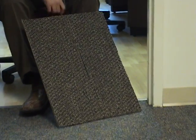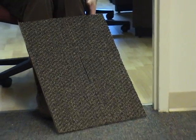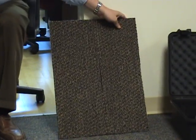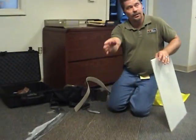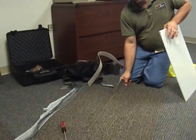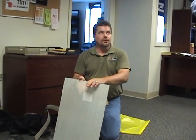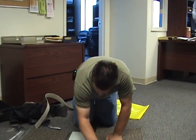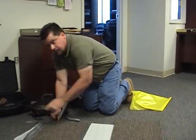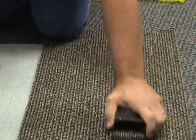Double cutting is like wallpaper. You put one piece on top of the other and overlap them, then cut through both pieces. Because of that, there's no way to keep it square. If it's skewed, you're going to cut through and get the zipper effect. But you get a square if you cut the way we're cutting, because we're cutting with the direction of the carpet, the way it's manufactured. You're cutting with the pattern. Even so, Paul, if they're not square, they should put the two ends under the baseboard. In other words, where it's not square, that's where the unsquare goes.